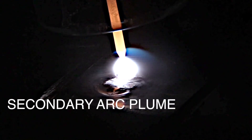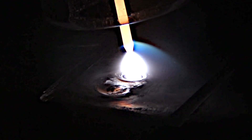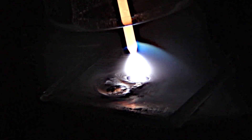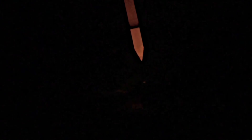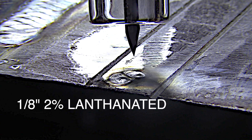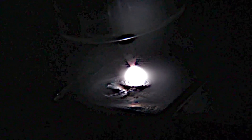I'm going to hit the pedal and go 60 amps with the 040 electrode, and you can see right away the whole electrode is getting red hot. Up inside that cup the whole length is red, and you can see an extra plume, an extra arc, some energy fanning out — and I think that's the key. That makes for a wider bead than you would think, even with a small electrode. Now let's look at the one-eighth electrode at the same amperage — 60 amps. It's confining that arc a lot; only the very tip is getting red hot, and that's why it made a narrower bead. I didn't really have any arc start problems either, since I sharpened it on a tungsten grinder at the same angle for a nice fine grind.